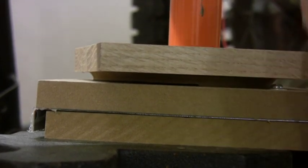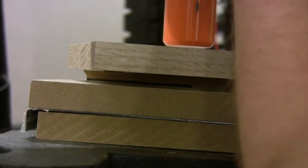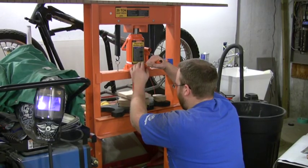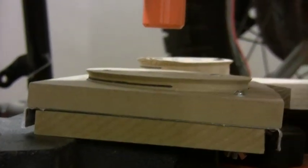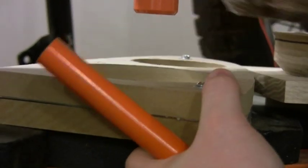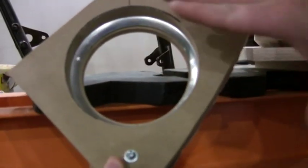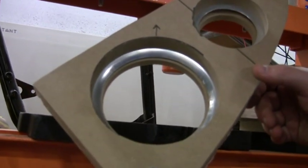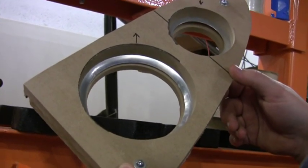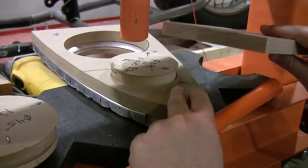So let me just back the jack off. This just lifts out. And you can see how it pushed the aluminum all the way around, nice and level. Gives you about a 30 to 35-degree flange on there. And no cracks — so that's a good one.